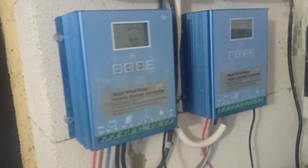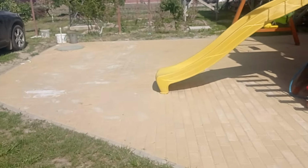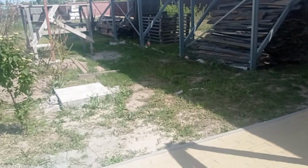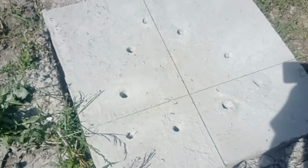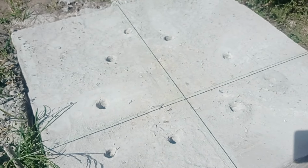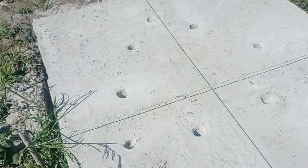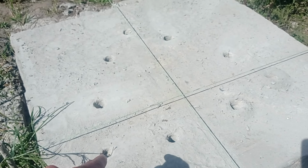So very soon we will be mounting the wind turbines, but we actually have been even trying to do this, but there was a small trouble. Let me explain to you which exact one. Remember, I initially told you that probably 12-14 days might be good enough for concrete to get some initial strength for the chemical anchors to be mounted, and that is going to hold the mast, the tower. But actually this Saturday, it was like 3 days ago, because today is Tuesday, we drilled only 20 centimeters down, and starting from 15, it was still wet.